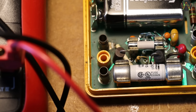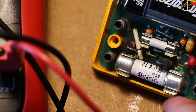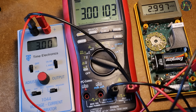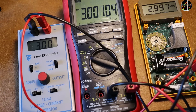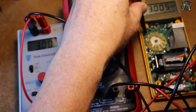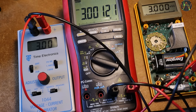And speaking of which, the ordered 15A fuse finally arrived. It is important to buy these from reputable distributors because there are lots of fakes on the market, especially on eBay. As a finishing touch, I decided to do a calibration against the BM869S. Calibrating a Fluke 23 is very easy — just apply 3V DC in the DC range and adjust a single trim pot so the meter reads 3V. That's it. This one step calibrates everything else: AC, currents, and ohms.